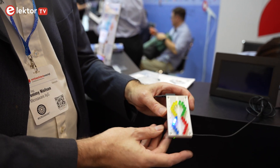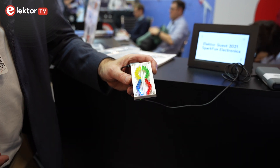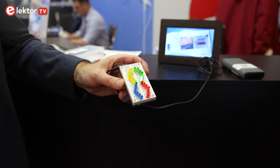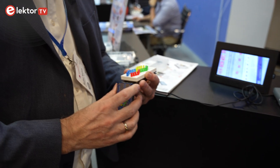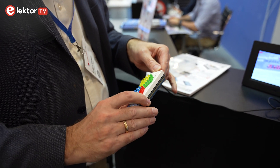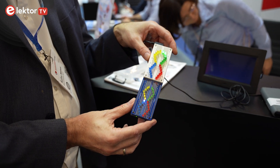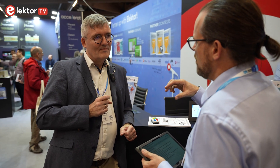That's a really big help when doing construction. Some components you have to place yourself; others we will either have as direct components in the breadboard or will synthesize from analog and digital components inside the breadboard. These will have a digital twin in the KiCad system as a component and be embedded in the breadboard itself. We also have silicon jumpers inside, so those connections — nodes that are not in the natural rows — we make with silicon inside. A lot of construction will actually be jumperless. So basically you have a breadboard as you know it, but underneath there's a layer of analog-digital intelligence which you can configure to complement the circuit you're trying to build.